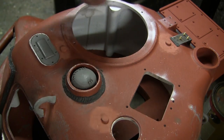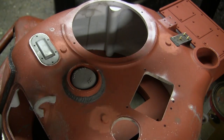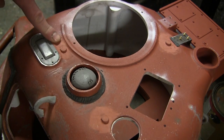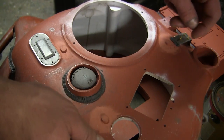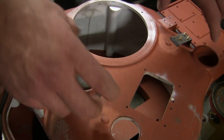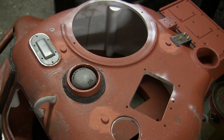The way the lugs functioned was that they were drilled in the centers and they were tapped. To actually use them, you would take large eyelets and thread them into these three locations here. The three eyelets then give you a clipping location for the crane to have these three locations clipped in order for you to hoist up the turret via crane.